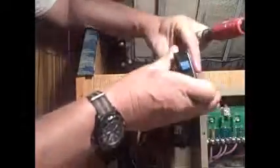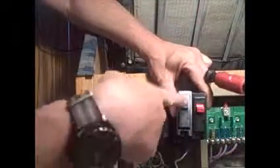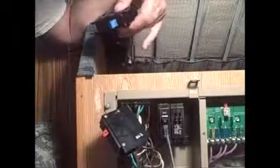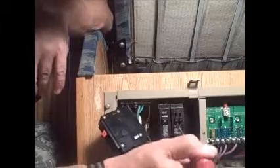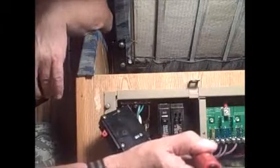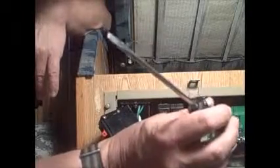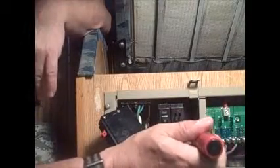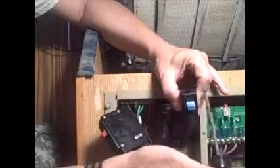What had happened was, in the past, I only had three breakers. I had it set up with black, blue, and red. The black was my power in — that was the 30-amp line from outside, and this breaker was switching that. The middle breaker was basically all of my appliances. I had one breaker handling all the appliances and the circuits — the circuit for the microwave, the circuit for the refrigerator, as well as running the TV and that sort of stuff. All was slaved off of one position breaker and one circuit.